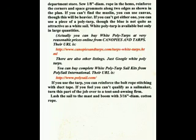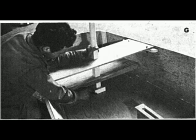Rudder assembly. Saw the half-inch thick plywood rudder to shape and fit plywood cheek pieces and filler block. Pin a tiller shaped from hardwood to the rudder with a carriage bolt. The drawings show how to make rudder hardware from brass rod and bar stock. Photo H. If you prefer, buy ready-made pintles and gudgeons at a marine supply house. Now your dinghy is ready for painting and rigging.